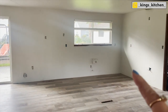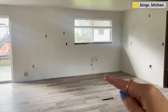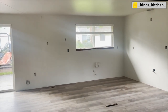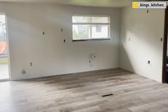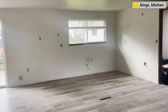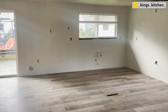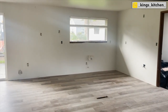When it comes to windows, I'm always measuring the distance from the floor to the bottom trim, or to where that windowsill is. Sometimes you have windows that sit a little bit lower and you're thinking maybe you want to raise the window because you want cabinetry to go underneath it. The standard height of a cabinet in the US is 34.5 inches. So when I measure a window, I check — in this case I might be at 42 inches AFF, which is short for above finished floor.